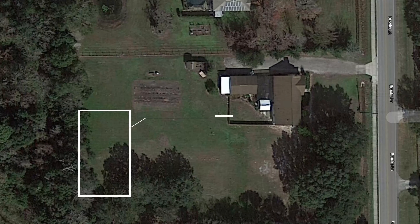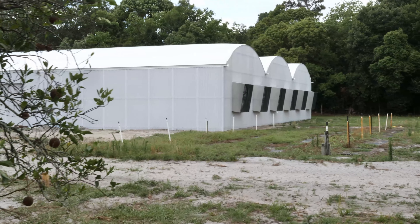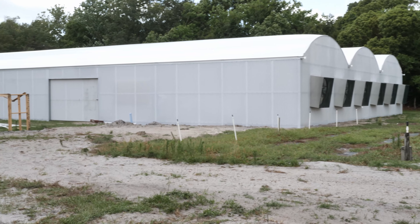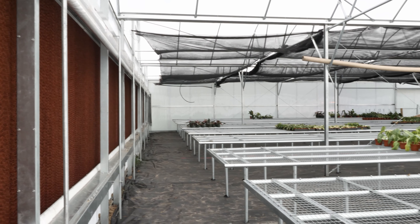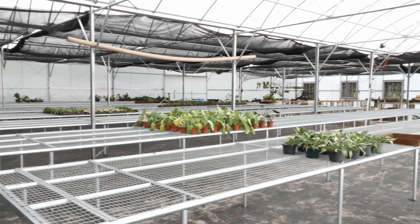The total dimensions of the greenhouse are 96 feet long. Each hoop is 22 feet 9 inches, or just call it 23 feet, which makes the entire dimensions of the plot 96 by 69 feet. There is one center aisle and the center aisle is 10 feet wide with the doorways being 12 feet wide, but the benches now installed on the left side do take up two feet of the aisleway.